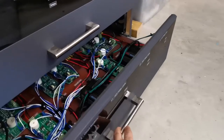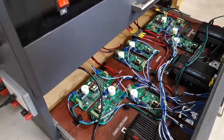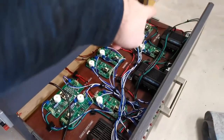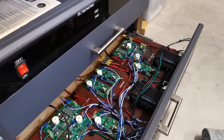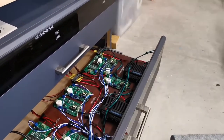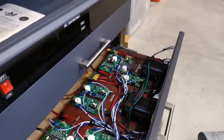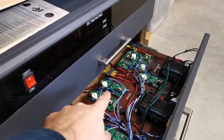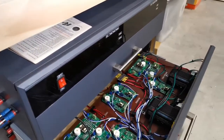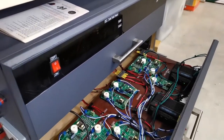And down here in the bottom drawer, this is all my power districts. So over on that far end, that's level one. As I said, I've mentioned three buses there, so one for the north side, one for the southern side, and then the reverse loop in the middle there, right here. That's level two, as I just spoke about, where I'll have a bus line for the main lines, and then I'll have the branch line on a different DCC bus line.